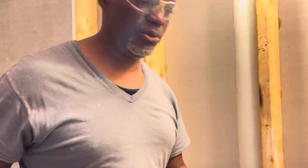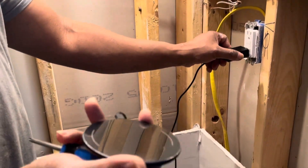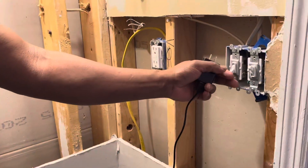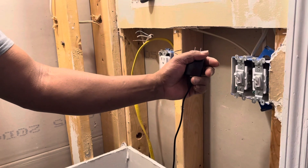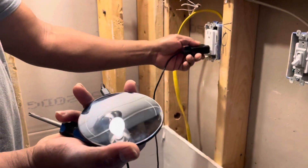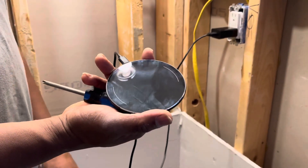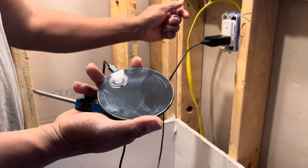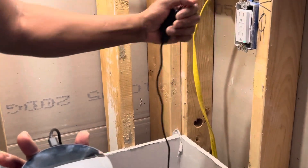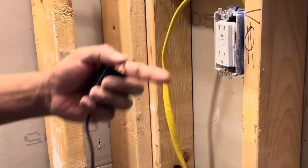Once I brought it through here, as you can see, now we got power. If you plug it up — obviously this is my regular light, this is my ceiling fan, y'all can hear that. Now if you hit this, watch this, it should light up green. Obviously no green, which means it's a GFI on safety protection. You want power, you hit this — boom — see it turns green, now we got power. If water was to hit that, it'll shut off.